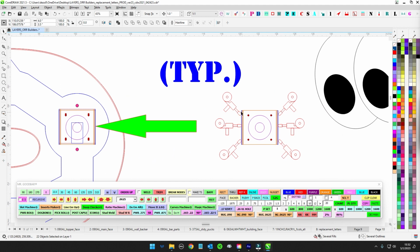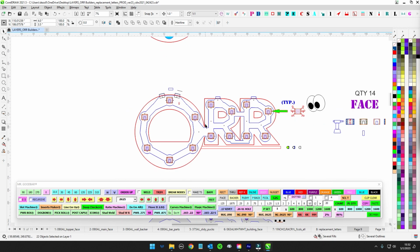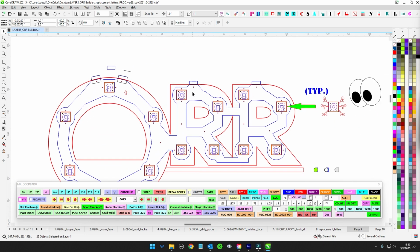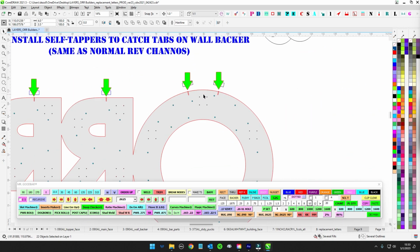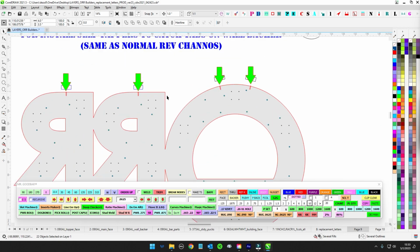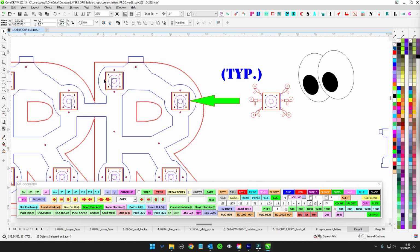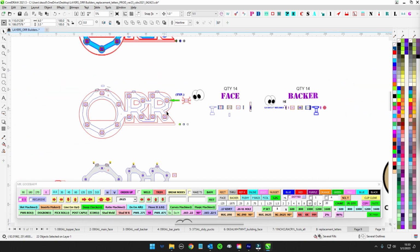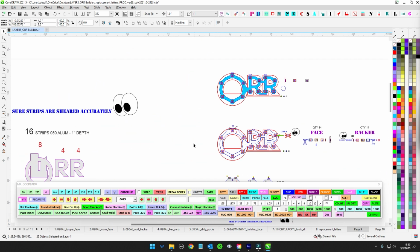I'd like to do the verticals rather than the horizontals. That way you will have more attachment. You're passing the weld through the rivets and it's more structural. So I don't know if you want to maybe lay out the reverse first and then weld on your little pucks there, and then weld the returns on, because the pucks are only going to be 3/4 inch tall. So that would allow you to get your gun in here. But you can just make that assessment. I don't know which is better, to weld this first or weld the back, the sides.